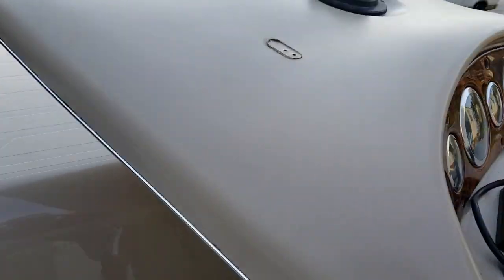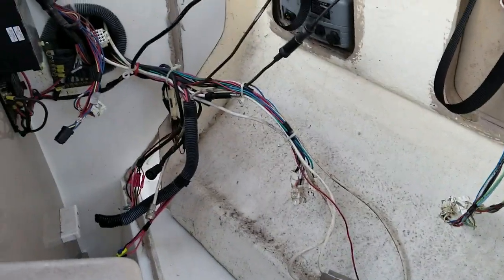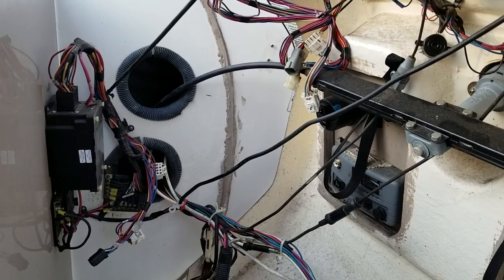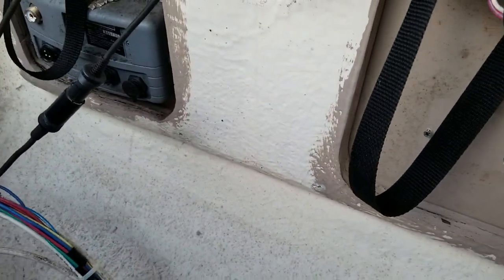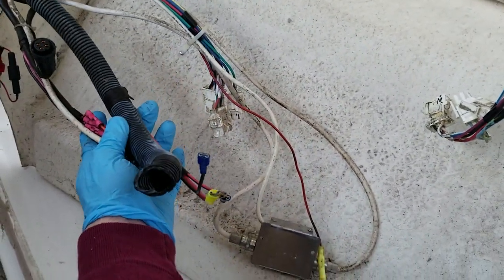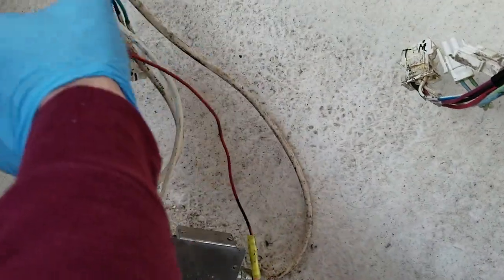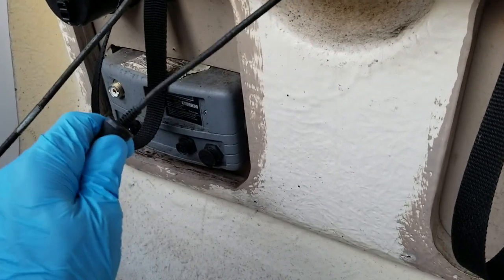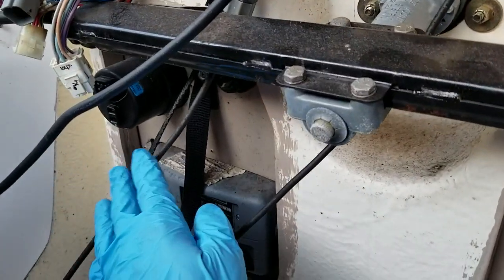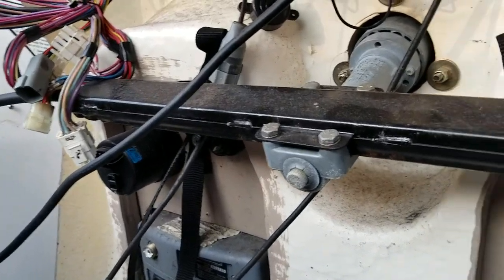I don't have the helm out completely but I'll film the backside because this might help you understand what you're doing when disconnecting the wires. I'll pan around slowly so you can see where the different wires are. This harness down lower here is what I disconnected first. I can see now that this wire actually does have a connector that I could have disconnected. This right here goes to the remote for the stereo, so I could pull that apart. I have one more wire here that I can disconnect.